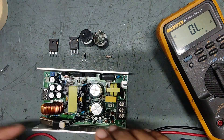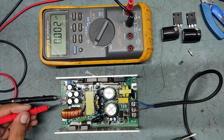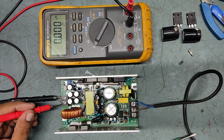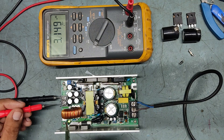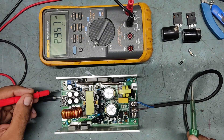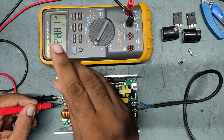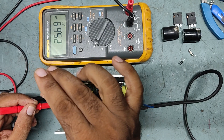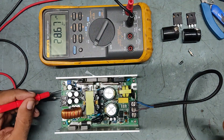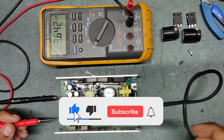We have fixed everything back. Now it's time to check — we will put it on. This is 28 volt — putting it on now. See, 28 volts just came up! The green LED light is on, which means our power supply is okay. This is showing 14.5 volt on one output and 28 volt on the other. We can vary this if we want. It's almost 14 volt. So guys, this is working perfectly.